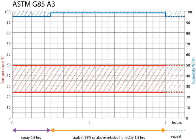Chamber construction, testing procedure, and testing parameters are standardized under national and international standards such as ASTM B117 and ISO 9227. These standards describe the necessary information to carry out this test, including testing parameters such as temperature, air pressure of the sprayed solution, preparation of the spraying solution, concentration, pH, etc. Daily checking of testing parameters is necessary to show compliance with the standards, and records shall be maintained accordingly. ASTM B117 and ISO 9227 are widely used as reference standards.